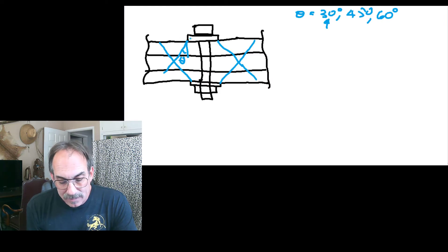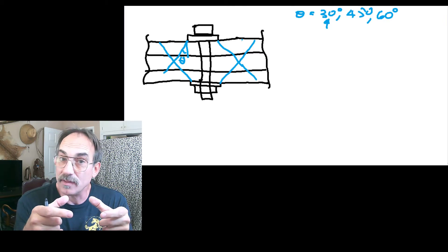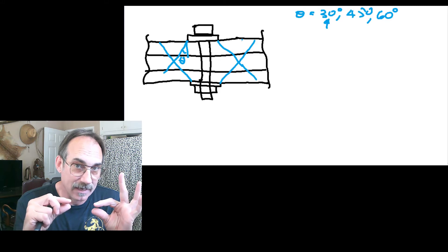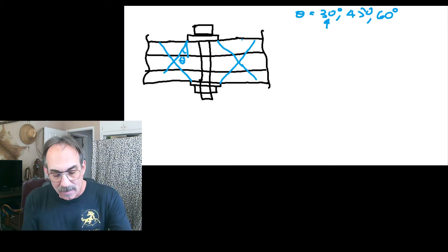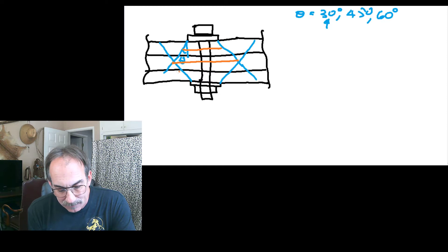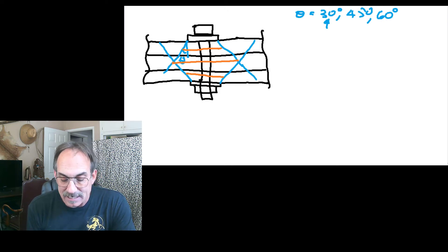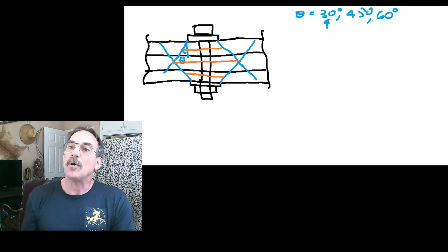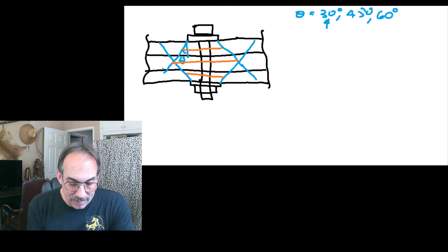What we're going to do is go from underneath the washer. We'll assume that everything beneath that washer — as long as the washer is not too much larger than the bolt head and is fairly thick — is squeezed plus some members below. The key idea is we have to find the effective diameter at the mid-plane of each and every plate. In my book and other lectures, I give a formula for this that really focuses on a two-plate member, and students get confused when trying to apply it to multiple plates.